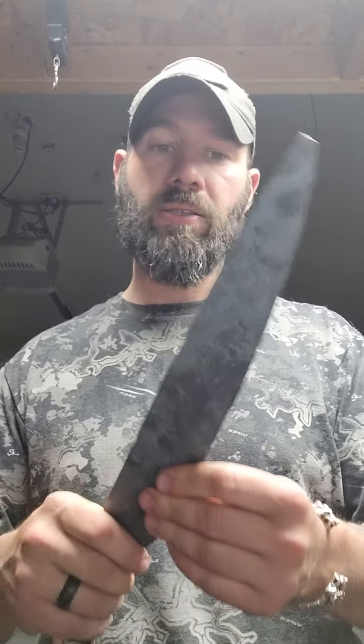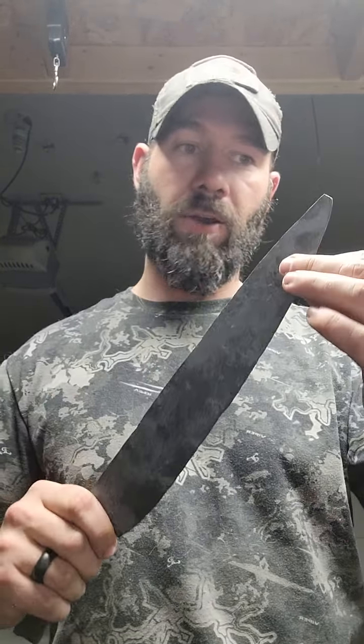chef knife. Okay, and these are two failed ones for a customer on heat treat because I went too thin. So in order to counter that, I'm going to have to do all my fancy grinding and profiling after heat treat, or more so the grinding, putting the flat grinds in, because I did forge those bevels in. And that's a big part too when you're forging a blade. Let me get to my notes here. When you're forging steel, that means many things. Blade geometry. So this is blade geometry.